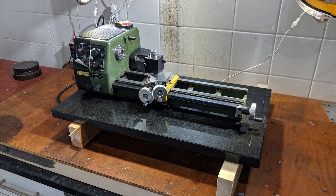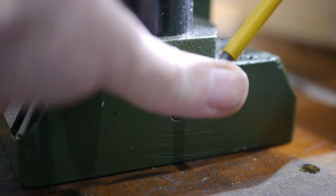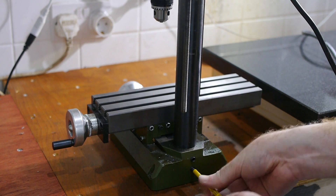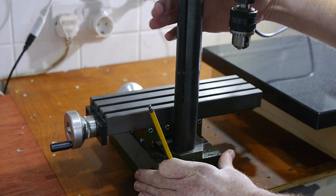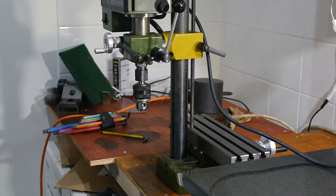All it needed was a couple of holes drilled to match the mounting holes in the lathe. The supplier had offered to drill holes in it when I ordered the plate, but I didn't have the foresight to accept their offer. I made use of an obscure, unintended feature of my milling machine — the screws holding the column into the base can be loosened, which allows me to swing the column around so the cutting head is no longer over the table. This allows me to drill precise holes into far larger surfaces by placing the entire machine on the surface, a bit like a magnetic drill.